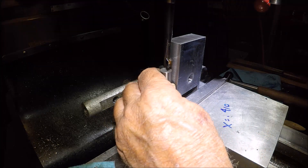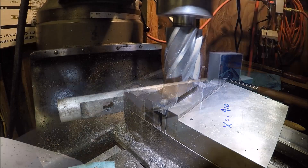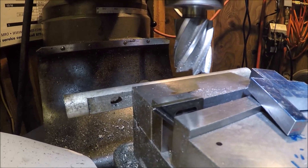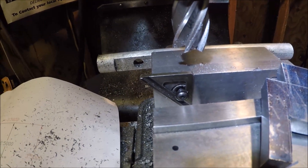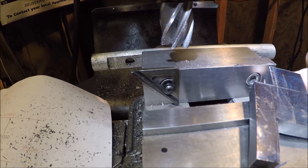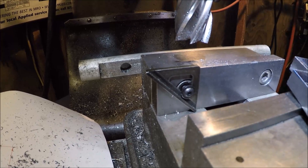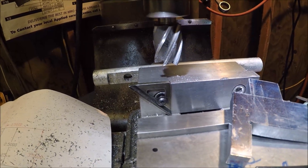Just checking with a gauge pin — 660 thousandths, good enough. Here's a quick shot of using one of Stan Zinkowski's squares set up in the mill. It worked really well. I drilled and tapped all of the mounting bolt holes so I can go ahead and use mounting screws for holding items. Great tool stand — thank you.